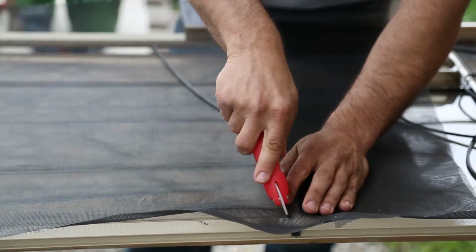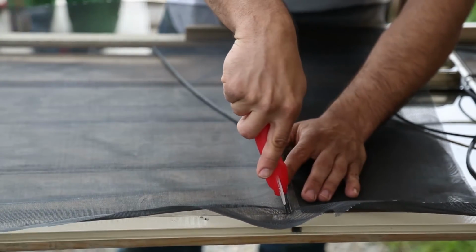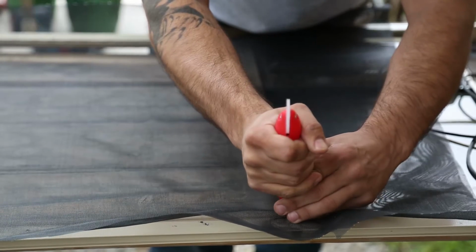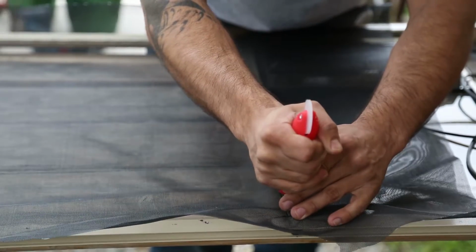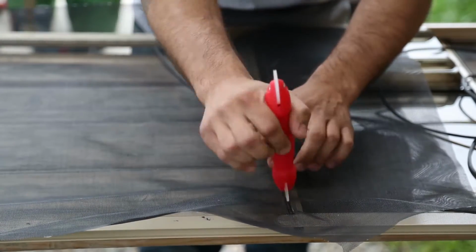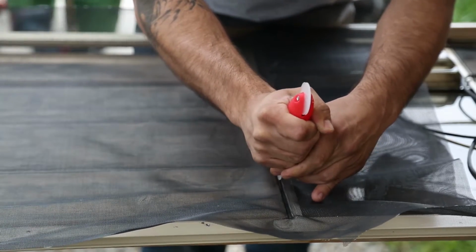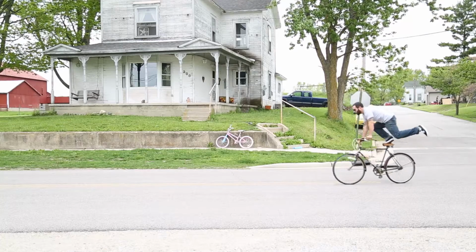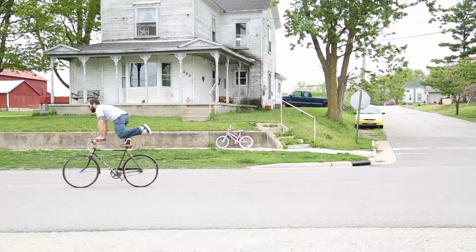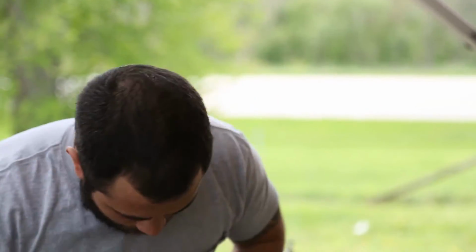I want to start with them right there in the end. Be careful with your roller that you don't hit this side of the screen or you'll begin to rip it. You'll see with this splining material, as I put it back in, even though it was evenly fit, it stretched a bit. So what I got here is a little bit left over.